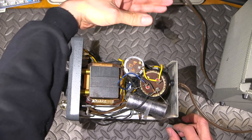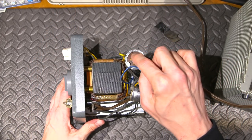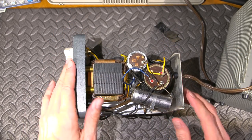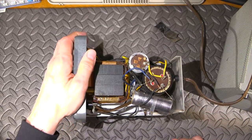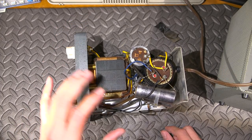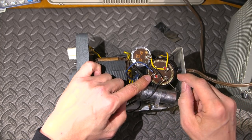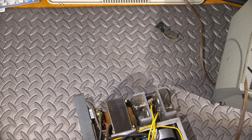I think this is going to need a restoration as well, so we'll do that down the road. There are two capacitors tacked in on this one and another one over here - somebody's really been adding capacitors to this thing, probably trying to get rid of hum for some very delicate use. This is a plastic body and it's taped up against it. It looks like they paralleled some capacitors - these two here are in parallel across this terminal, and they've paralleled this one in across the other.